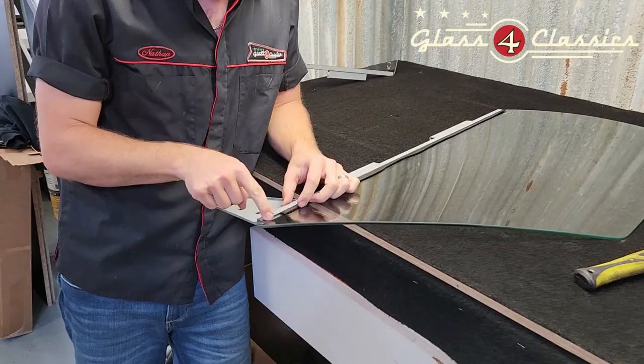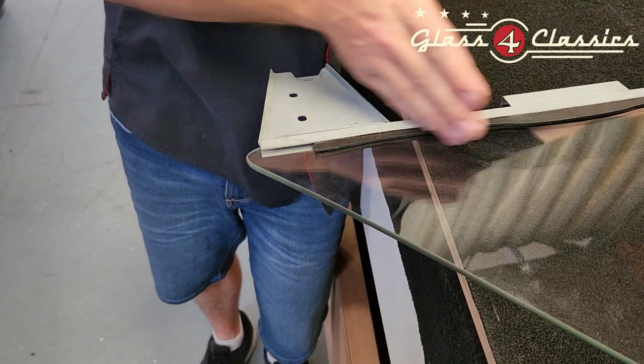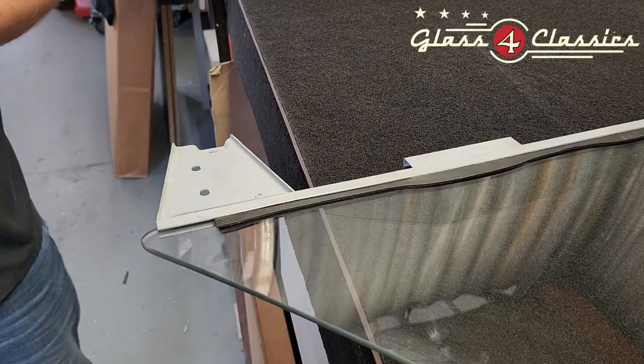The reason I leave this inch at the front is for safety. These brackets are quite weak, and you can see as I move this, it moves quite readily on the glass. This is nice and tight all the way along, but there's not a lot of strength in the front of this bracket. And if you've got these brackets in the door adjusted incorrectly, it's putting a lot of tension on it.